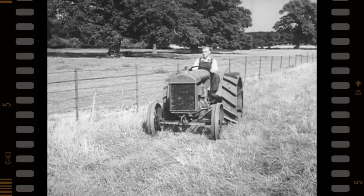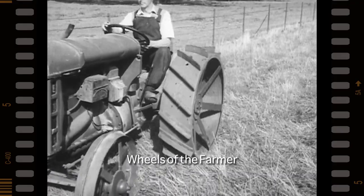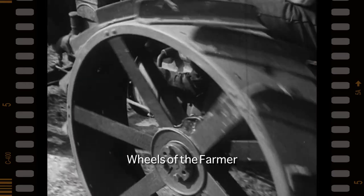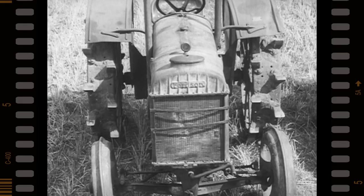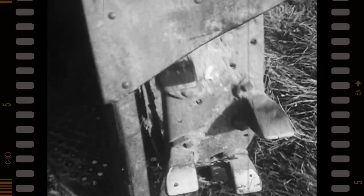The sense of urgency diminished, and during the 20s, little new development was apparent, and there had certainly been no basic change in the tractor wheel. Designed primarily for traction, it was thought that this purpose would best be served by steel wheels fitted with strakes. Since these wheels undoubtedly gripped, the great wastage of engine power was accepted as necessary. Indeed, there was little difference between the wartime tractor and this 1929 model, although by this time spade lugs had come into use.